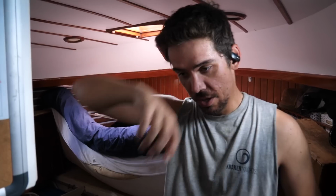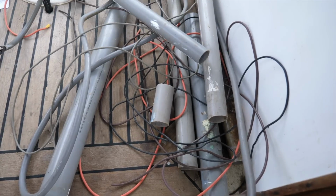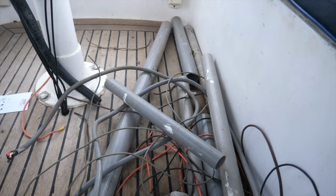Yeah, it's gone okay. One of the downsides about redoing your engine system is you're possibly liable for some massive 2 naught or 1 naught gauge wiring runs at significant lengths. Plus side for us is we had a system where the house bank and the starter bank used to run to a switch and then to the alternator. So we had this redundant length of 2 naught wire. I've just spent the morning cutting it out of these massive pipe conduits that I imagine are original, and reclaiming all this wiring, which was fine, but the runs were excessive. I had to rearrange it and reroute it.